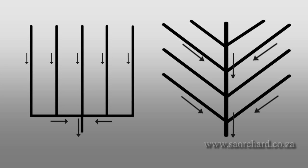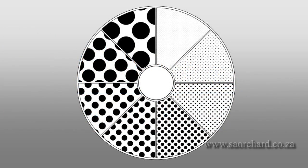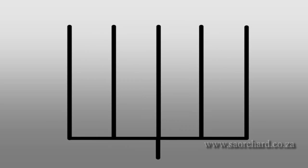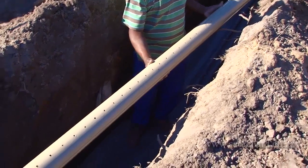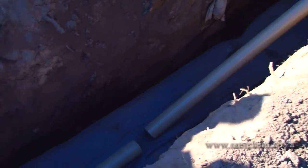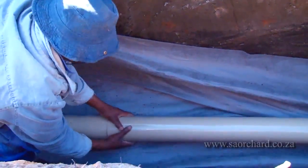The spacing between drainage pipes depends on the soil condition. Coarse fragments in the soil will cause good natural drainage. Soil that consists of fine particles will drain more slowly and pipes will be placed closer together. The deeper the drainage system, the further apart the pipes can be placed. Perforated PVC pipes of either 75 or 100 millimeters in diameter are used these days.